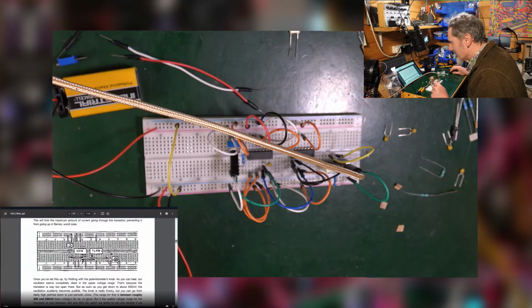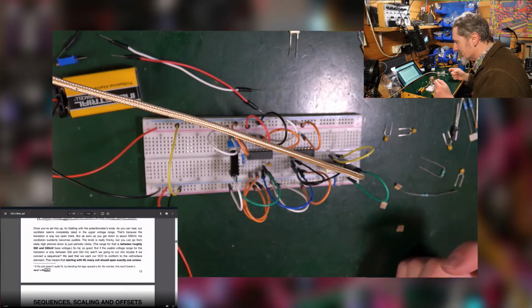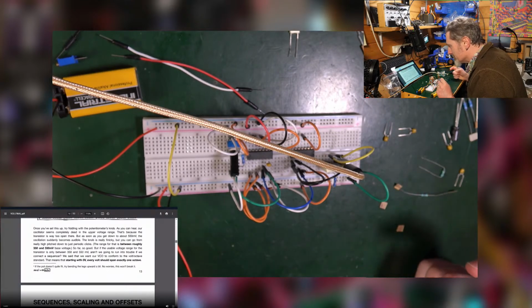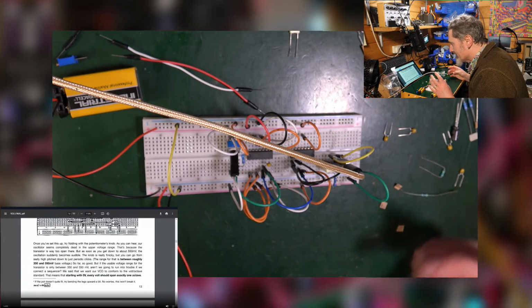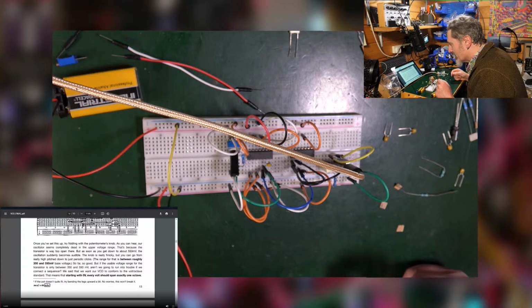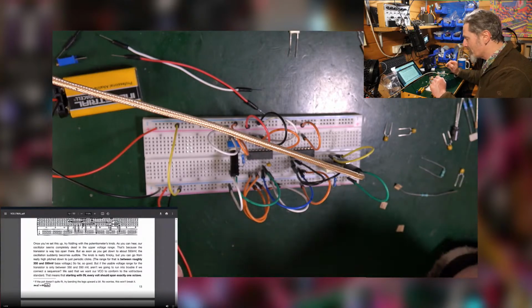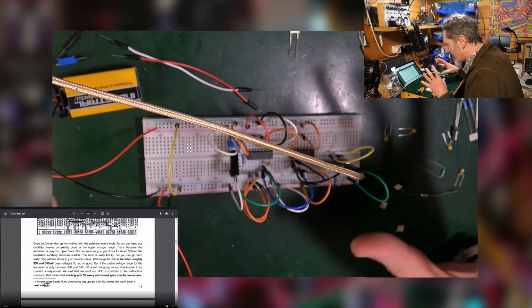Now, okay, so once we've set this up, try fiddling with the knob. Yeah, did that. So yeah, it's swinging about a bit too much. As soon as you get down to something, it becomes audible. Yeah. The range is roughly between 350 and 550 millivolts. Also, I do have the wrong capacitor in at the moment, so it's going to be a little bit different to that, perhaps.